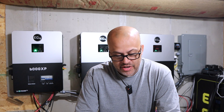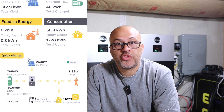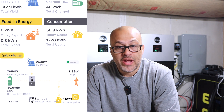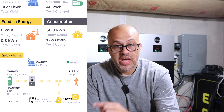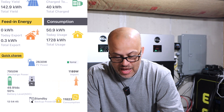This is still going back to the main panel because I don't have all the solar panels hooked up yet. After I left I recorded it on my phone while they were using more power - their house was using 11,023 watts, most of it coming out of the solar panels and inverter: 2,630 watts from solar panels and 7,950 watts from the battery. That's just the one battery, basically regulated down so it won't pull more than the BMS will allow.